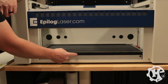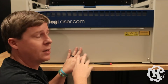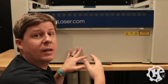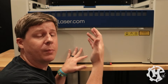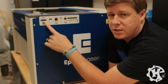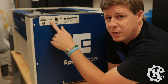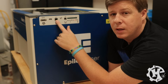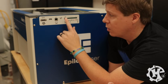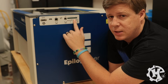This will also give you access to the belts underneath the bed. The other cool part when you go to put the panel back on is that there's a magnet, a pin, and another magnet to help guide it into place and put it back on correctly. On the right-hand side of the machine, we have an exhaust control plug, a USB plug for firmware updates, an Ethernet plug where you can control it via Ethernet or USB, and indicator lights for the status of the machine.